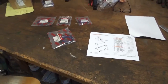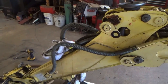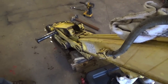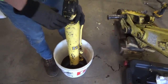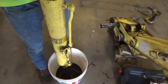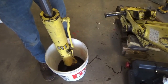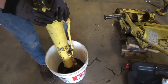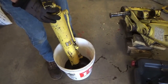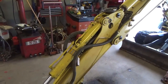We'll get this torn apart and show you the seal installation on the bench. My son will be doing that — he's good with that kind of stuff. This is how we usually do these: just pop the pins, unhook your hydraulic hoses, pop your pins, and just have a bucket ready. Put that cylinder in the bucket and just cycle the cylinder and it pumps that oil right out of it. The hydraulic oil in this machine will change fully when we're done with all this work.